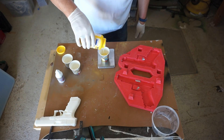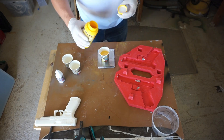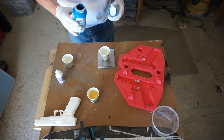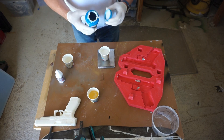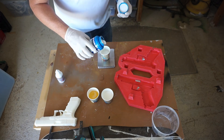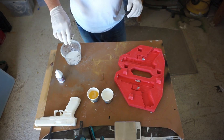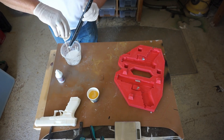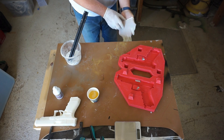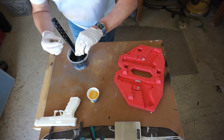Mold is prepped. We're now measuring out the amount of polyurethane needed: 60 grams of the yellow bottle and twice that of the blue bottle. Halfway through, my first bottle ran out so I had to grab a second batch. I realized I should have measured the white component directly into the mixing cup, but this way I know for sure I'm doing the one-to-two ratio without having to do mental math. Now adding black colorant — since I haven't mixed the other parts in yet, I can take my time and mix the coloring in thoroughly.